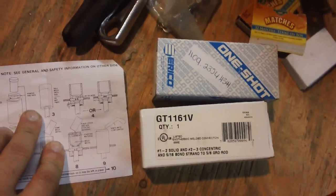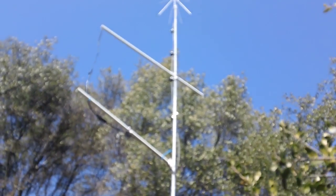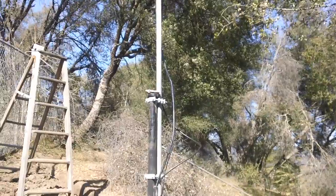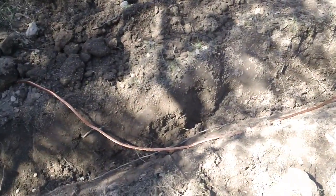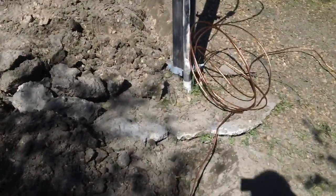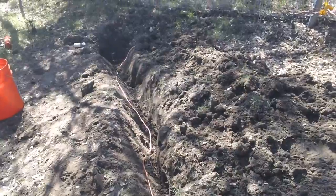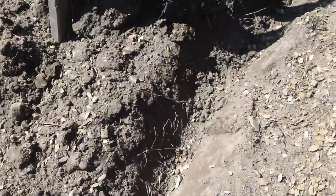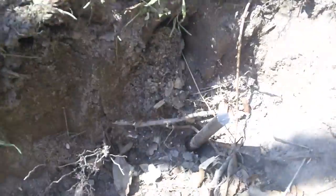Finally we're at the last stage of my installation — lightning protection. Up here on the hill I have number four gauge copper wire and a ground stake pounded at this location. I have a trench going over to the base of the tower mast, eventually hooking up here, at least eight feet away — the length of a grounding rod. I also have another one going eight feet in the opposite direction, with another grounding rod there.